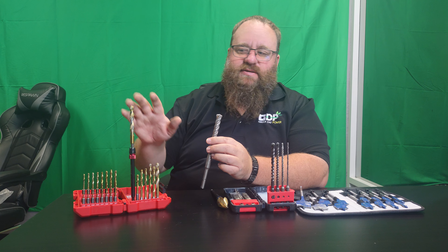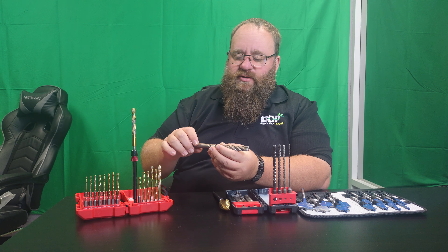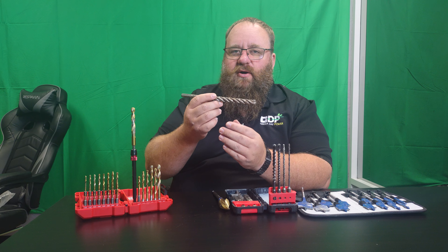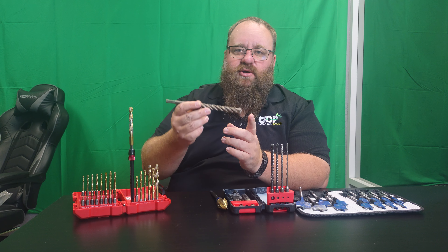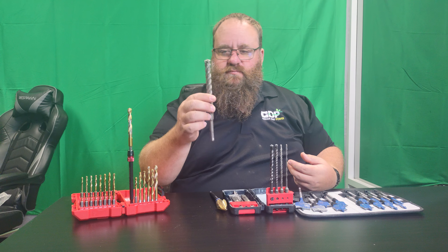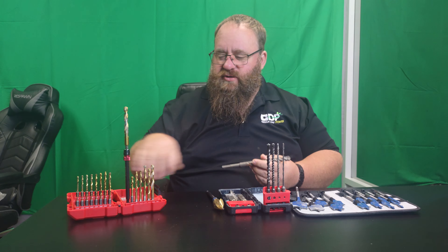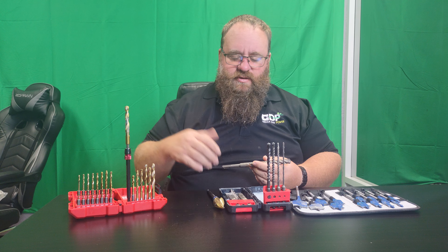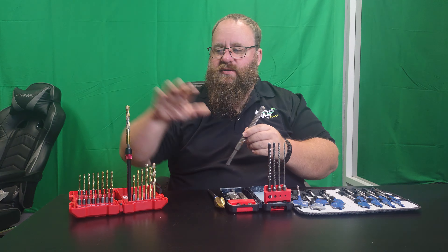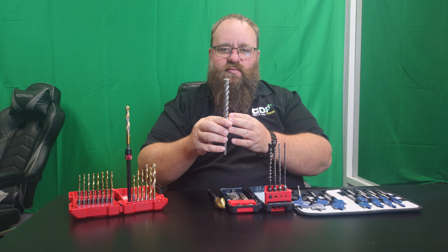Try to stay away from wood-only bits in this application — they will not cut through any kind of metal, and if you hit anything they will completely tear up. Also, buying versions that are designed to cut through rebar is a really good idea. Buy good bits, guys — stop buying junk on eBay. I keep lots of different sets in my truck and I usually keep a double set of every single bit, because the one bit you break is always the one you absolutely need.